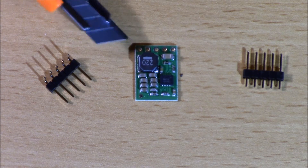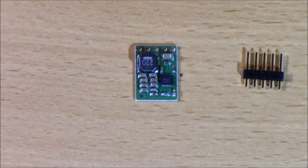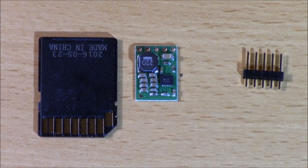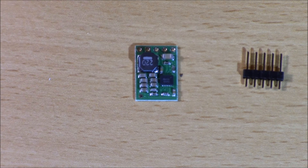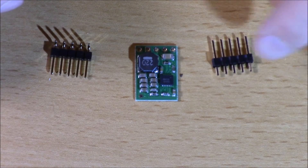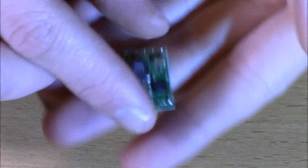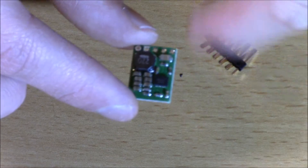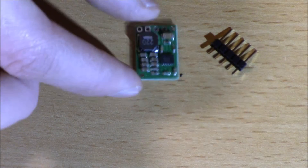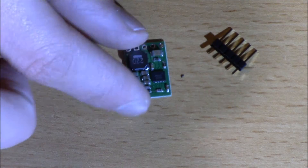You can see here a really small package — here are the pins, and for some size reference, here is a normal SD card and here is a micro SD card. So it's just about the size of a micro SD card, which is amazing especially for saving weight while flying. This comes with sets of bent pins and straight pins with standard 0.1 inch spacing, so they can be used with breadboards. Really small, really awesome for filtering out your voltage for video or electronics.